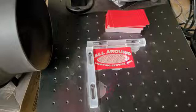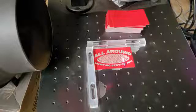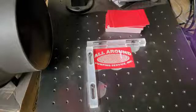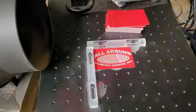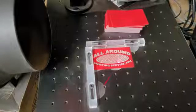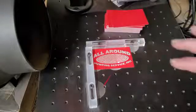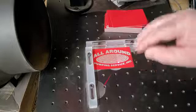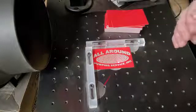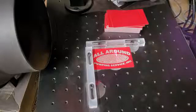You can see it cleans up those letters — everything that's been burned it will clean up. I'll go ahead and pause this in the middle so you can see. You can very clearly see the difference between the right side and the left side. The cleanup pass is running at half speed — a little less than half — with fatter lines of resolution, and it's also running very low power. I think I'm running 20% on this pass, but it makes a big difference.